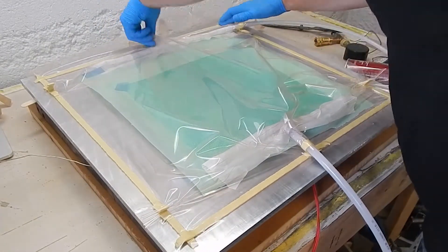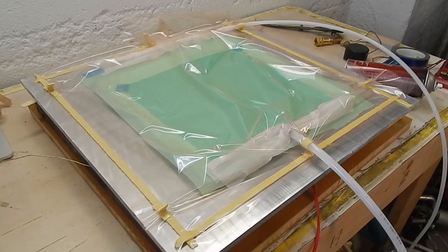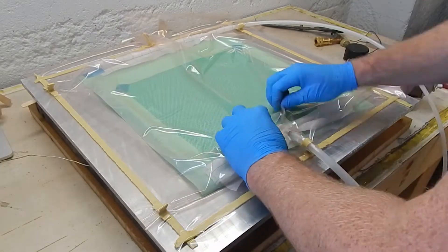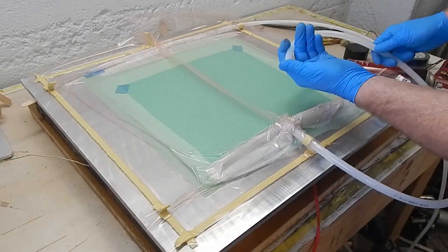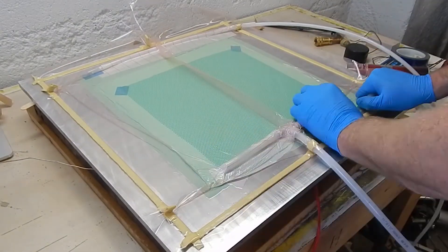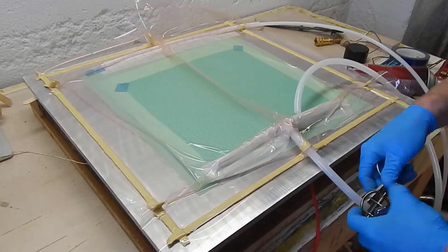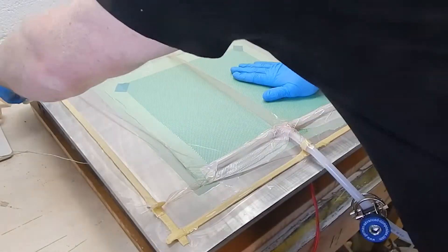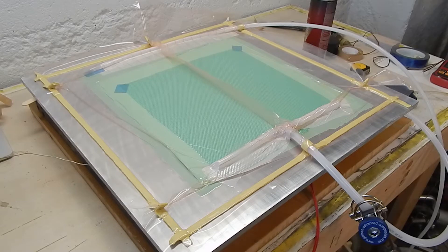Pulling the bag down, making sure the pleats are very even. It's not going down anywhere near as much as would be typical — this is more the vacuum pressure you might use for bedding core or doing a bagged wet layup that didn't need to be well compacted. It's really not that much vacuum. It's strange to feel how the bag looks and feels at only about a third of full vacuum — 10 inches of mercury, or about 700 millibar. I clamped off the hose and let it sit for about half an hour, then checked with a gauge: about 10 inches of mercury.